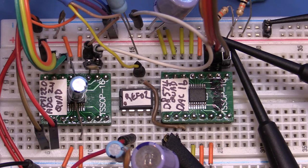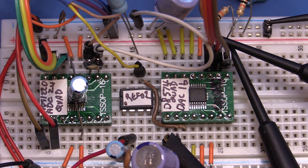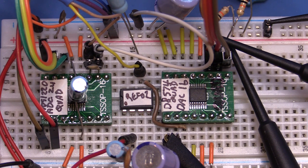What I'm going to show you now is first we'll get the analog to digital converter working, and then we'll try and get them both running and monitor the output. In another video, I'm going to hook this up to some kind of LCD display so that we can use it almost as the basis of a control system for our power supply. For this demonstration, I'm just going to use Serial.write and Serial.print commands from the Arduino to put it to a console so we can see what's happening for the ADC. When we do the DAC, we'll create some kind of loop and put my oscilloscope and Agilent multimeter on the analog output to measure what's going on. Let's get this thing powered up and start looking at some sketches to make this work.